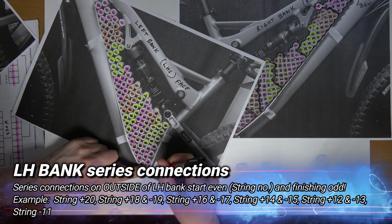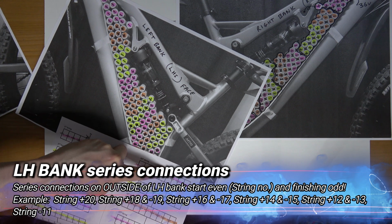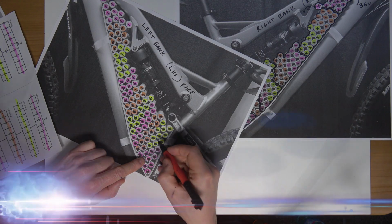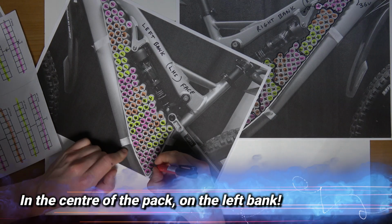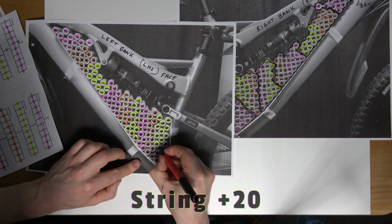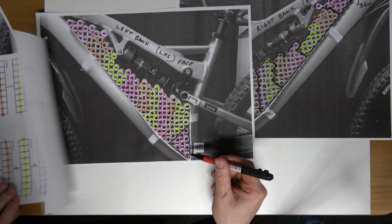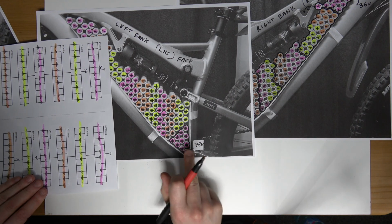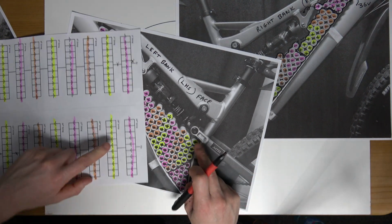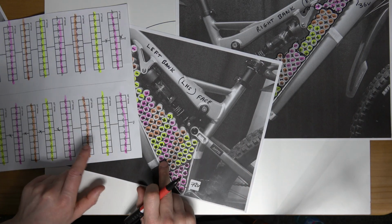So here the terminal 72 volts. If I go back to the plans, at this point where the terminal comes into the 20th string, this string is connected to the 19th string on the other side. So I'll just draw this to show what I'm talking about. Okay, so there's where the 72 volts has been taken off. Well, the terminal will be connected at this point. So the 19th string now, yellow here, is connected to the orange. To the 18th string. Orange, yellow.